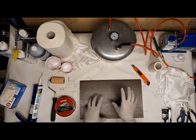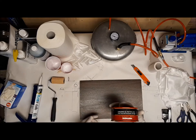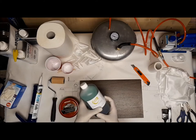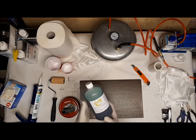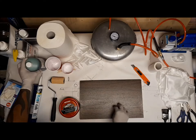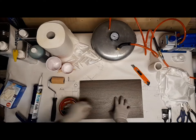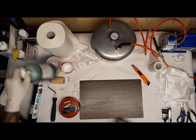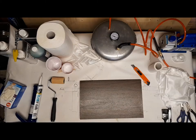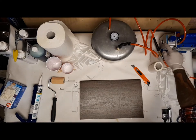Molding without vacuum is one way and with vacuum compresses differently. I used carnauba wax, waxed it on, then used two layers of PVA mold release. The PVA spray started bubbling on the wax so I just brushed it on. It looks good enough — the surface is not very smooth but good enough for testing. We're kind of ready to go.